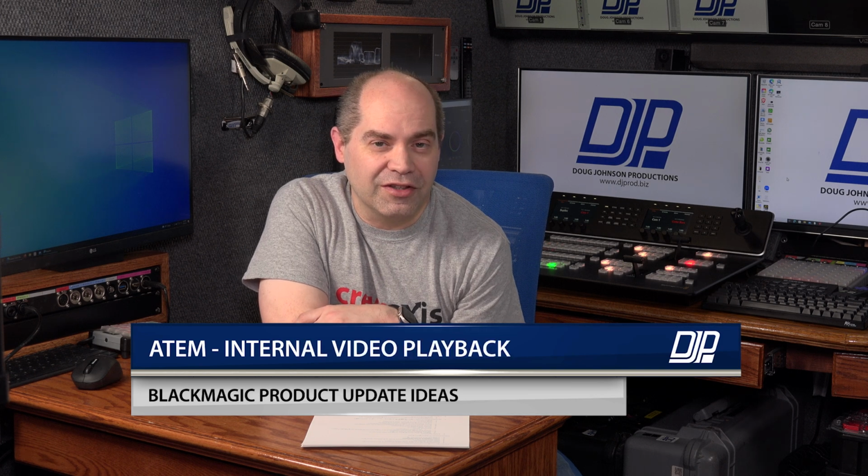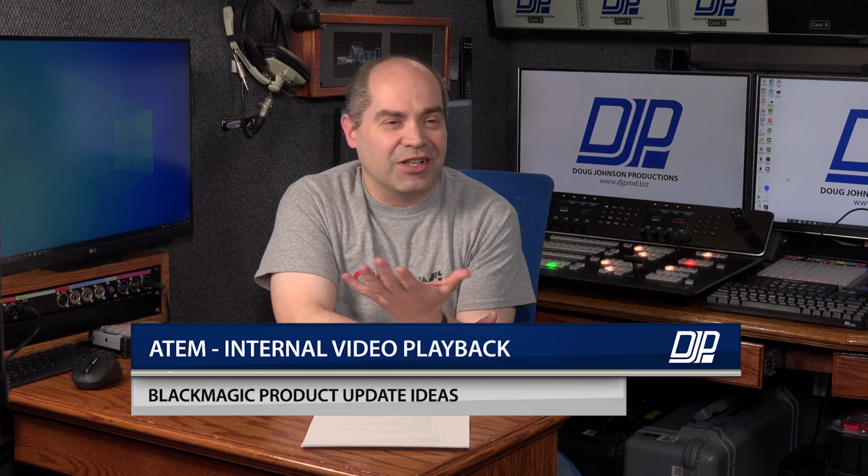So second to last on ATEM switchers is going to be the ability to do video playback from within the ATEM switcher itself. This is particularly interesting now because with the Television Studio HD8, we know that they are capable of putting MPEG-4 decoders on all of the input channels. They're doing that for the live streaming capability. Why not extend that a little bit and be able to play back from a video file that's on either the internal storage or a connected USB device? In the case of that model, the hardware is already there. In other models, it wouldn't be that difficult to add.